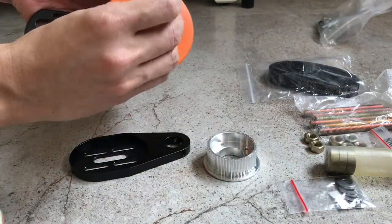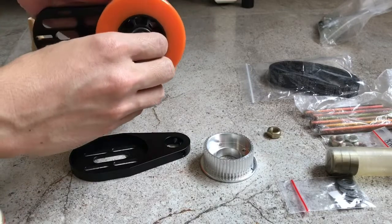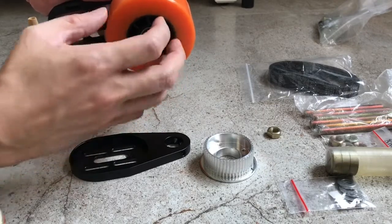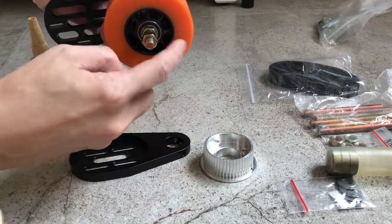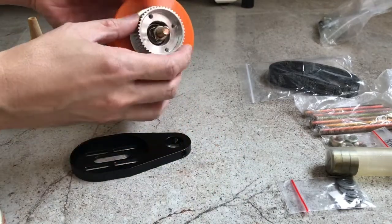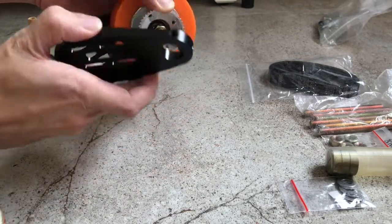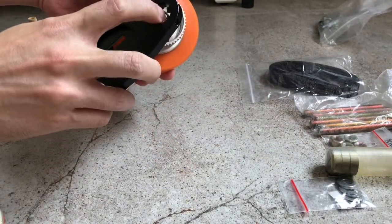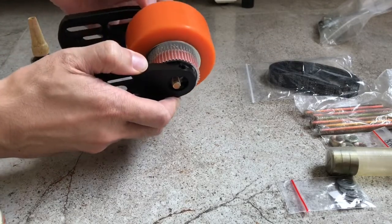Next we put another washer to protect the bearing, and then we use 2 more nuts as end stops for the other side. We're not going to tighten it all the way because if we tighten it the wheel is not going to move. We're just going to tighten it to the point where it's almost touching the bearing of the wheel, and then use another nut with the 2 nuts pressing against each other — that will act as a stationary end stop. Then we can put on the belt drive pulley, and this other bracket, which is from a different electric skateboard kit, will hold the other end of the rod. We need 2 more nuts, and by tightening these 3 grub screws I should be able to hold the other side, and that will form a very robust structure.